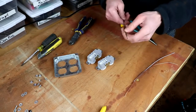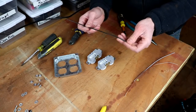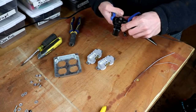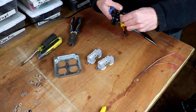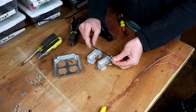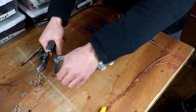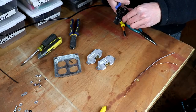To wire these together, we're going to find a couple pieces of regular Romex wire. In this case we're using 14 gauge because it's just going to be a lightweight circuit. We'll strip the wire off one end — about an inch — and then figure out how long we need it to be. About four inches should do; we don't really need much, and any extra is just going to get in the way.